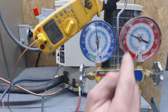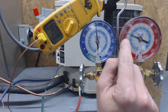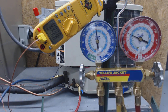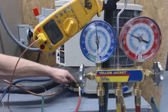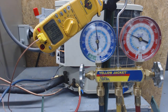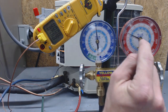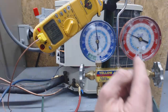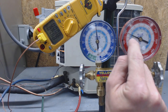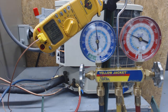So what you find here is you have 146 PSIG, and then on the outer ring — this is the liquid line — and we have the hose attached to the liquid core. We have a temp probe attached to the liquid line, and that's reading 78.8. The actual saturated temperature, as it states right here, if you follow the needle back to the green saturated temperature chart, it actually says 81 degrees saturated.